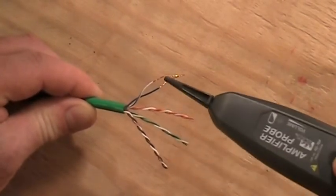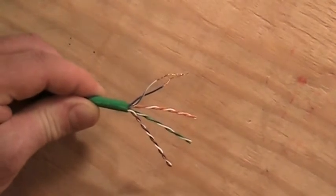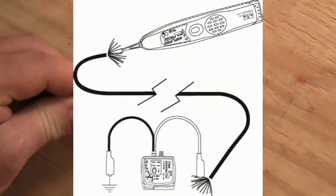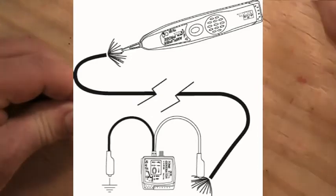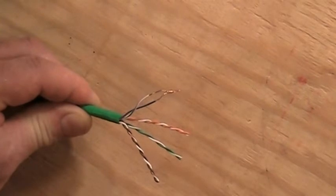You're always looking for the loudest sounding pair. A tip from the instructions: you may want to disconnect the black lead back at the tone generator, because Cat cable's twisting actually deadens and cancels the tone slightly. On long runs it's best to disconnect that black lead. And if you can ground it, even better — that may actually increase the tone level.